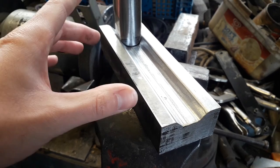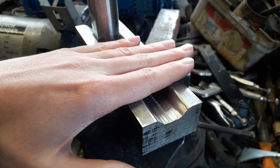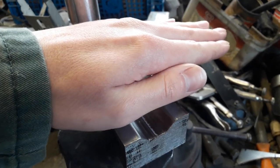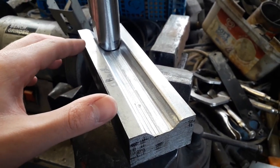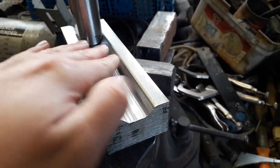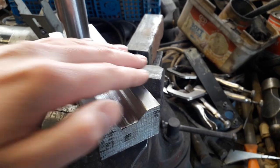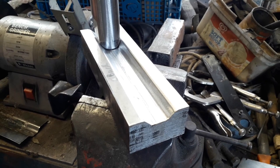And the reason for just trying to clamp it on one side is as I form the metal, obviously the flat piece of metal is going to be like this, and then it's going to want to pull into this way, and then the piece of sheet metal is actually going to sort of pull this way a little bit. So I just want it clamped on one side so I can use this as a datum edge, so I know that I can bolt it here, form it that way, and then when it comes to forming the next channel, I can move it along so much and then drill some more holes in my sheet metal, bolt that down, and then form it so I know the distance between the first strengthening channel and then the next one, so it'll be in the right place.